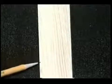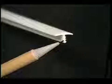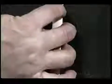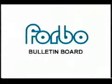Prior to your installation, you need to apply the color that will show through the gap. The width of the gap can be set by using a piece of scrap material or even specially designed spacers. Creating a seam using wood trim in between each piece of bulletin board is another attractive option. T-molding, J-trim, or H-bar can also be inserted between each piece. But again, you must preset the space using a piece of whatever molding you decide as a spacer between each piece of material. These are a few of the more commonly used seam treatments for installing the bulletin board tackable wall surface.